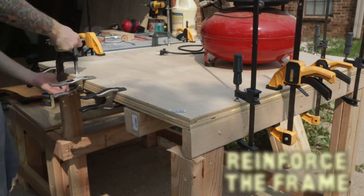This router plate fits the Bosch router that I have — I'll link it below. It's a really simple process: just trace the router plate, then set your router to just the depth of the router plate. Then take a deep breath, because it's time to tear into that brand new tabletop — it's all part of the plan. You've got to cut out the hole on the inside. You'll need a pencil, a claw hammer, maybe some calipers, but mostly a spade bit and a jigsaw.